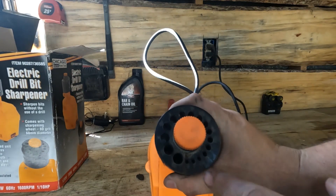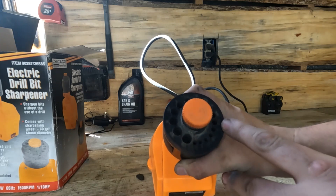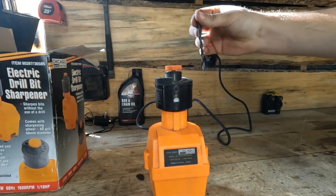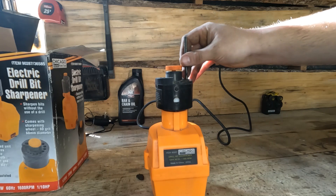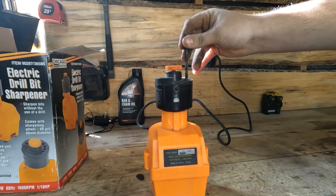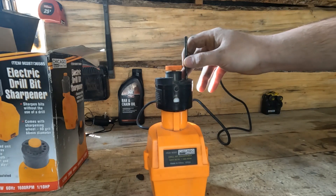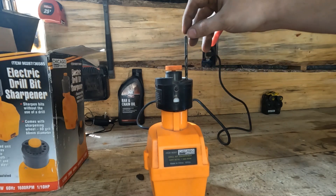This thing on top has got your measurements for all your drill bit sizes. Mine was like a 5.3, I think. Basically you turn it on, stick the drill bit in the hole, and let it grind on one side for a minute. Then you pick it up, twist it, and stick it back down to do the other side. This knob in the middle raises the blade up and down, so it gets a different depth on the tip.